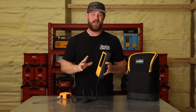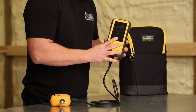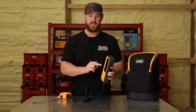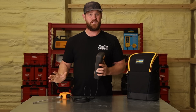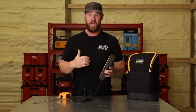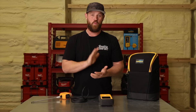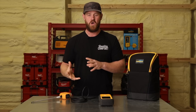When powering the analyzer down, you want to fully press it until it clicks, and then it's going to go through its countdown to remove any flue gases in the probe, and then show you 'sensor sealed' — telling you both sensors are now sealed off. Also, when doing the shutdown process, make sure the probe is out of the actual ducting and back in fresh ambient air. When you are testing your equipment, it's good to let it run for at least five to ten minutes so you can test all the parameters, make adjustments if needed, and ensure it's going through a full normal run cycle.